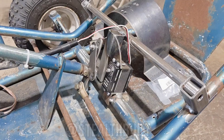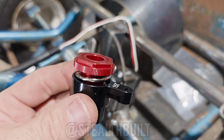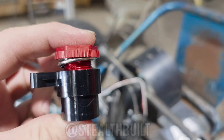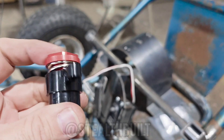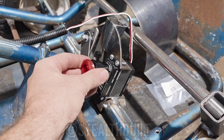The motor is still good. So everybody saw that other one strip out — I've got this new one and there's a little split in it, so this is spring-loaded. If this hits something, it's supposed to pop up and out of that little groove and prevent it from breaking the steering servo.